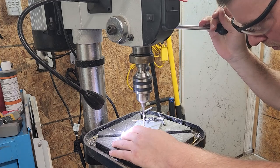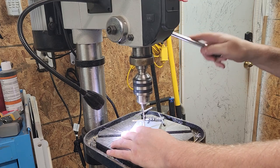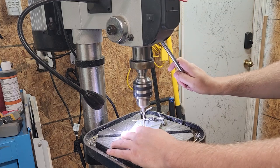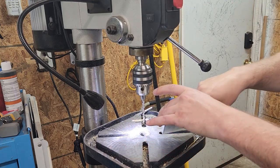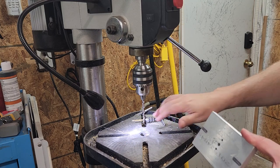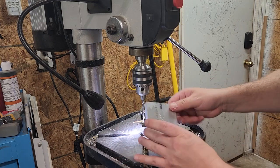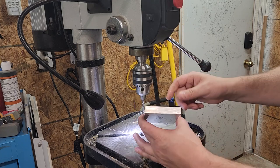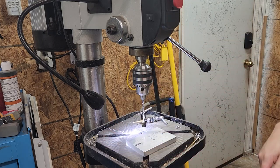Let's get some oil on the bit, do the same peck technique to make sure it's centered. Using the same peck drilling technique — you want to break those chips off. Nice and easy. That's the key to using a pilot hole: the pilot hole does a lot of the dirty work, figures out where in the material you want the hole, and then you step up the size. My large quarter-20 hole is far enough from the two M4 holes that it won't interfere, and it's centered in the material. That makes a very nice mount plate. Now we're moving on to tapping.